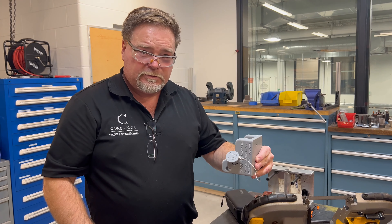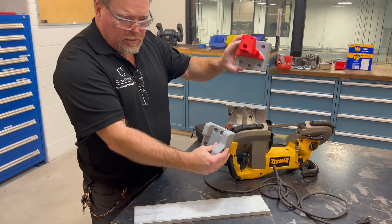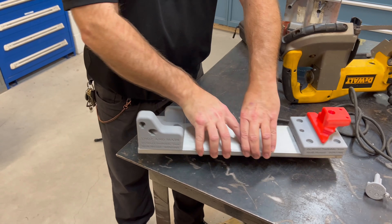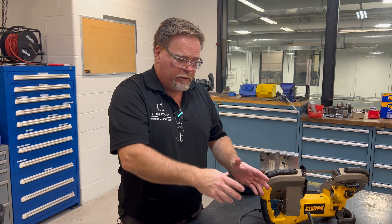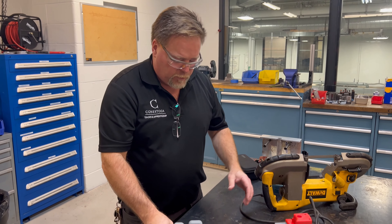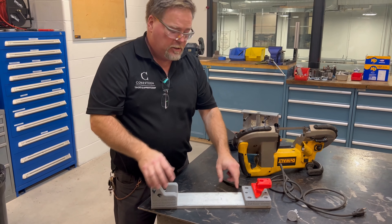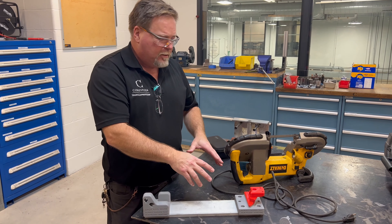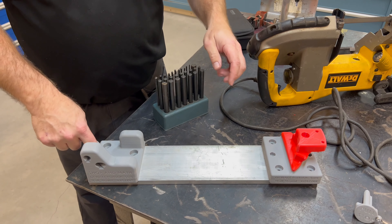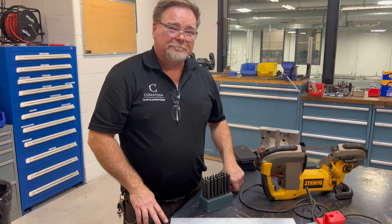This is our portable mount — you could just bolt this directly onto the wall and it would work fine. But I'm bolting it onto a separate piece because you might want to move it to a different location. The one I have is mounted on angle iron on scaffolding, which is the most convenient location in my garage. This one I'm making for my buddy Rob, so he can drill holes and mount it wherever he wants. I'll use transfer punches to transfer hole locations perfectly.